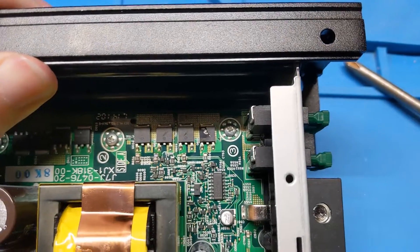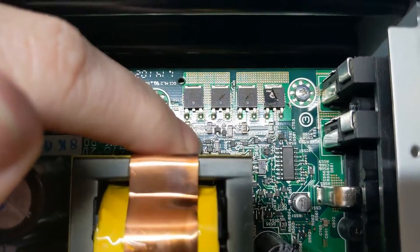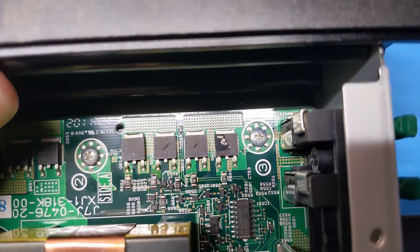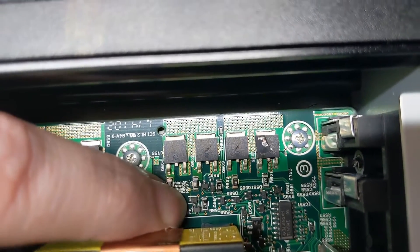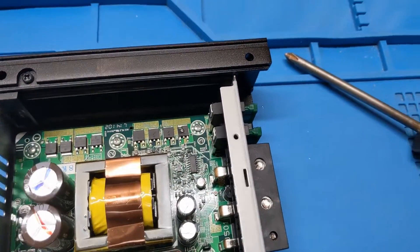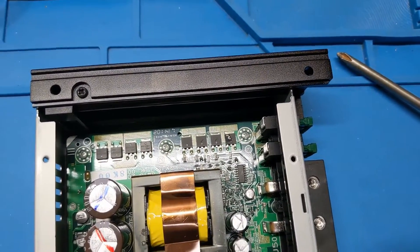So we're going to need four transistors and four resistors, and I have to find the driver transistors — there's one there, and if we follow the circuitry for the other one, yeah, there they are. There's a diode for dead time control, a transistor, a diode, and another transistor — these two work together to drive the MOSFETs. I don't have the schematic for this unit, but I'm sure I could probably get it. I'm going to see what I can do without it. Let me get in here and do some more testing and get a components list together so I know what we have to order.